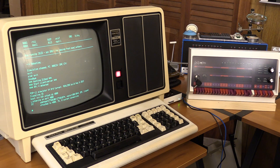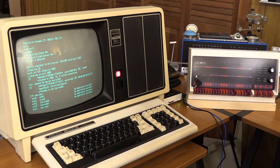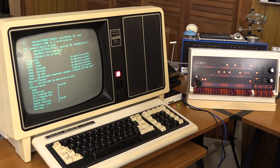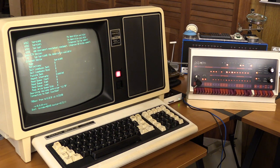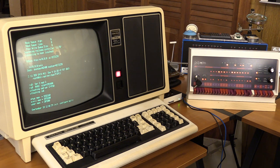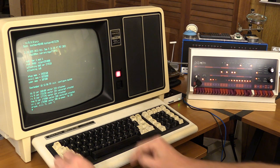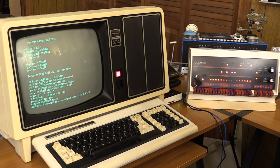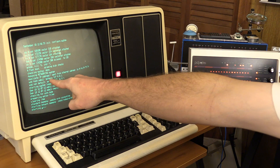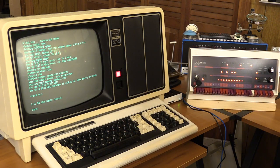Now this particular image is network enabled, and I did pre-configure the network. So that means some interesting things. And we'll just hit enter for the default boot. And now I have the maintenance shell, which I'm going to Control-D out of. You see I have a MAC address. Now I booted this up earlier, so the tunnel already has the IP address. It doesn't matter, it's not a duplicate.